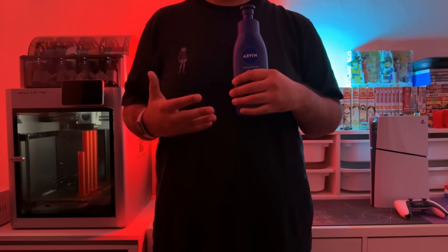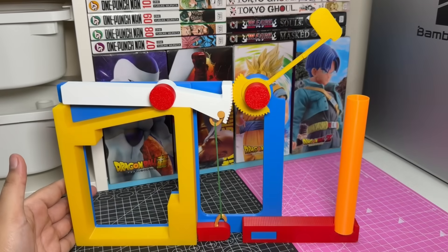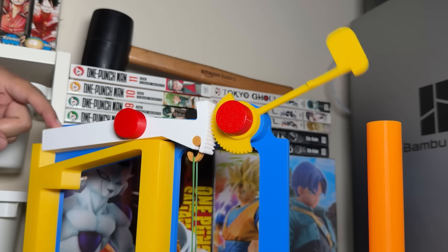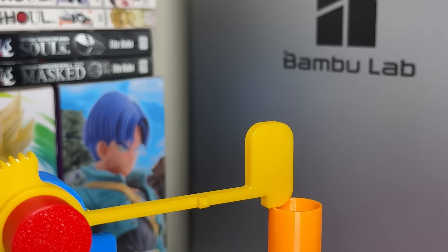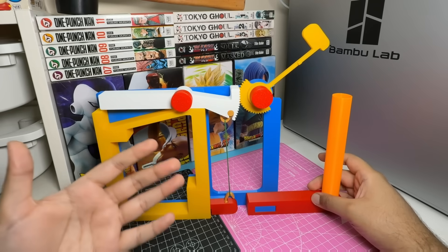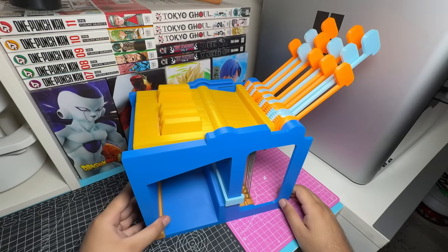I was a few days behind schedule at this point, so after a bit of quick brainstorming I came up with this rather simple solution. With just about 10 degrees of key travel, this hammer strikes its corresponding pipe with enough force to make a decently loud sound, and when you lift your finger, the hammer retracts because of a rubber band pulling on the front end of the key. We can replicate this for 5 black and 7 white keys.